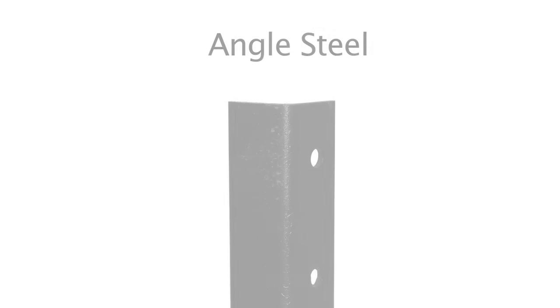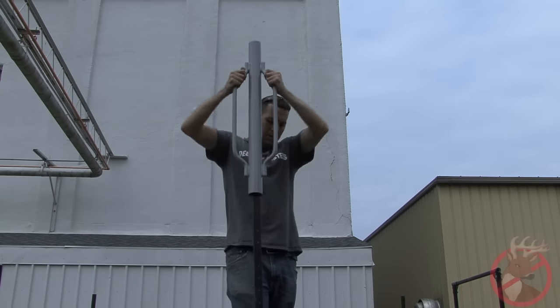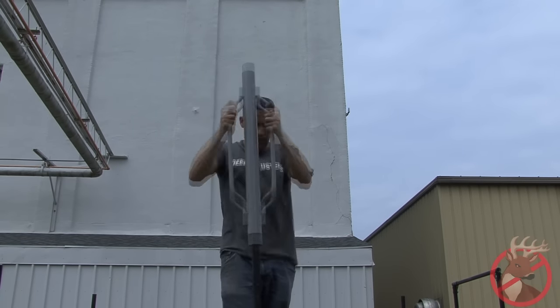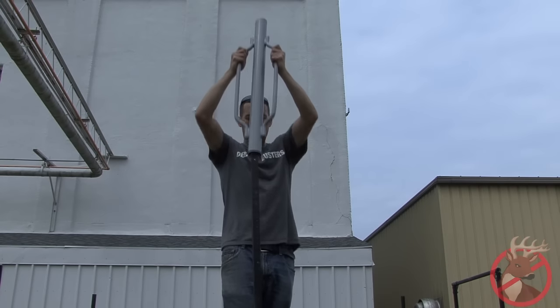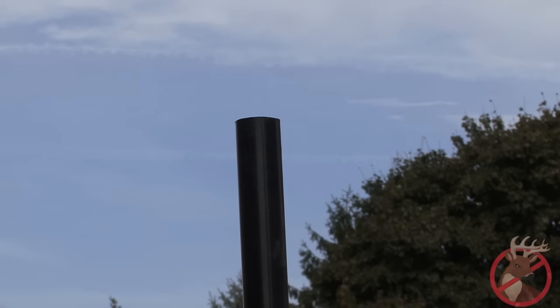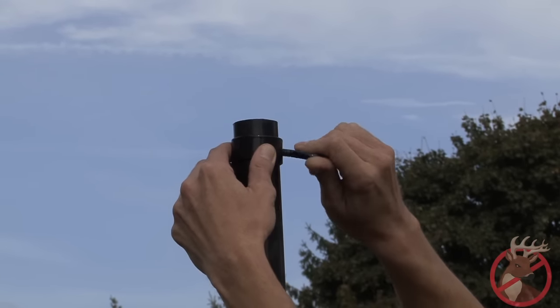The angled steel is black and forms a 90-degree angle. For angled steel posts, we recommend placing them every 12 feet. You may use a spring-loaded post driver to drive them into the ground. Hold it by its handles and use powerful vertical movements to drive it in. The post should be driven about two feet into the ground. After your posts are in place, add the bottom and top tension wire guides before inserting your vinyl cap if it is a heavy-duty line post.